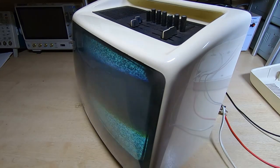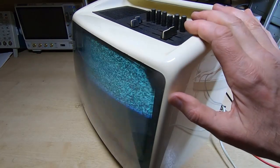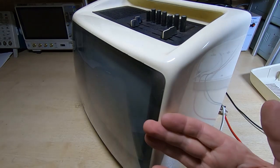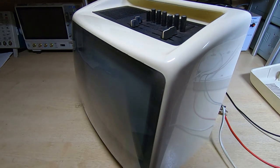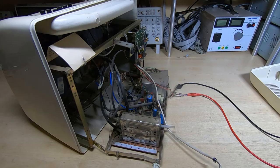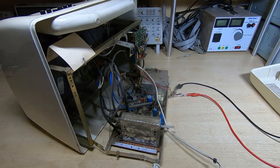Unfortunately the case is destroyed, so this is beyond repair. I'm going to use it as a donor for the CRT. In the next video I'll strip this down completely, get the tube out, and see if it's possible to physically fit it into the ADM3. It's possibly a shorter tube, so the only downside may be that we can't get enough drive out of the ADM3 CRT output to achieve proper deflection.